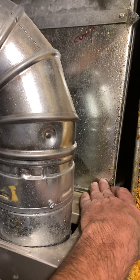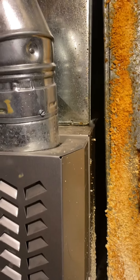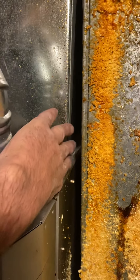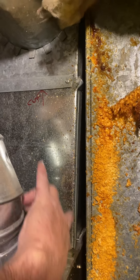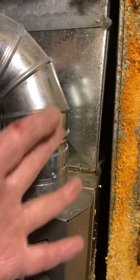Put the coil on a coil base. It kind of worries me a little bit — I made this bigger because the coil is the same size as a furnace cabinet, but this duct is half an inch smaller. That's why I made a piece the same and redid this piece, hoping the taper will be enough for the coil. I know the coil is smaller than the box, but without seeing the coil, I don't know exactly the size of the uncased part.